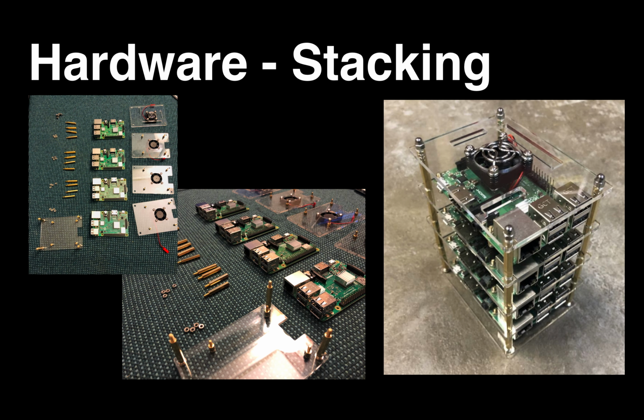And then get in and start stacking. Get your fine fingers out. If you've got a little mini socket along with a screwdriver, that can make life a bit easier. If you are a stickler for detail, note that the orientation and the location of the circles, cutouts for the fans on the plexi, they're not perfectly in line with the center with that notch on the side. So if you want everything to line up perfectly and look good, just pay attention to which side you've got up and do a little testing before you bolt it all together.